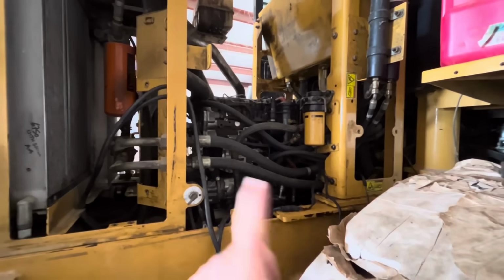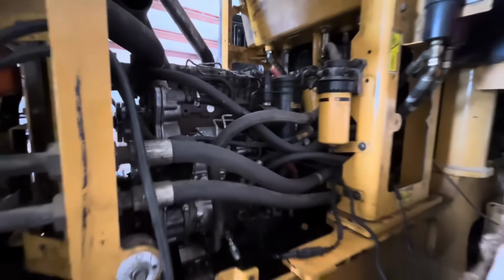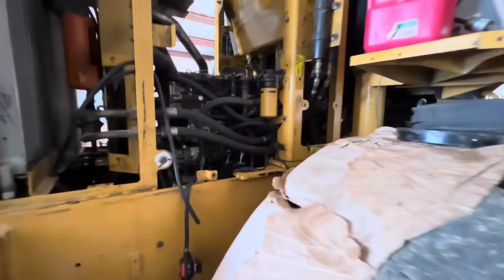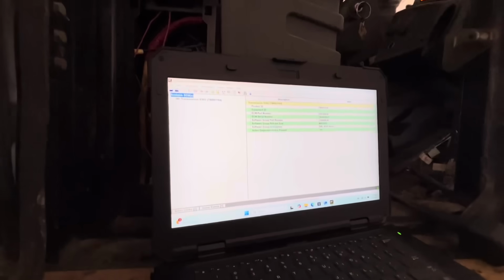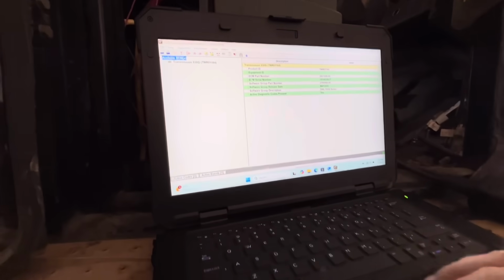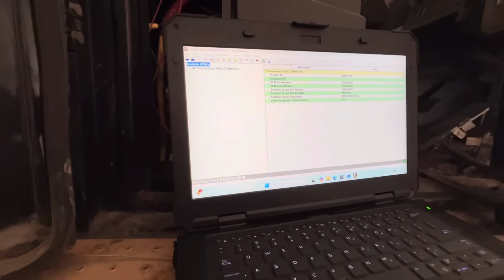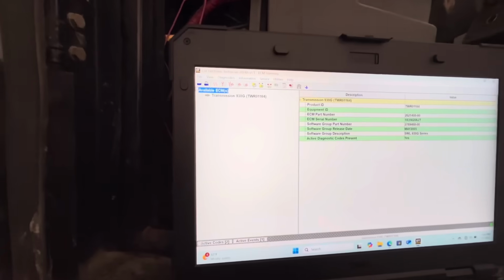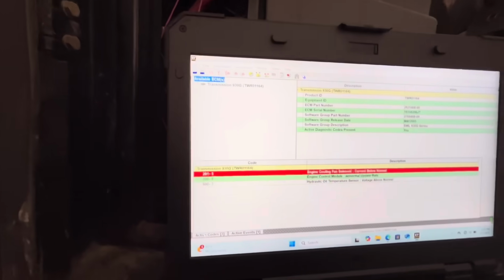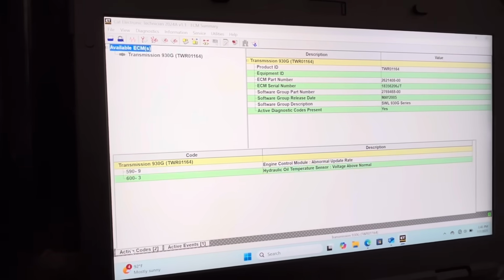Allegedly, they just went through the engine, built it. It's got a new pump on it. I think that's a VP44 style pump, if you guys are familiar with Cummins at all, or Cat. Anyway, it's like an electronic rotary pump. And right off the bat, we hooked the ET to it, and we're not seeing engine ECM. So let's figure that out first.